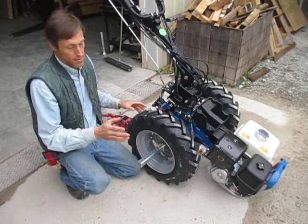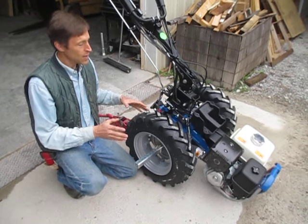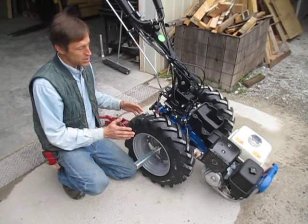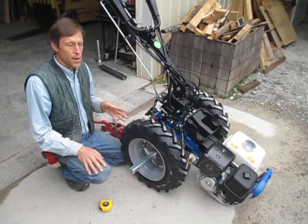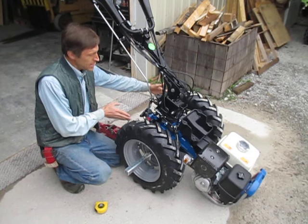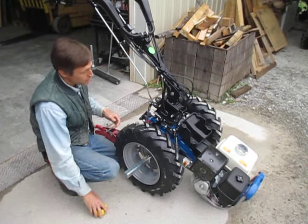Those being the ability to use the rotary plow when the wheels are slid into their minimum-width position. And to reiterate, as mentioned in earlier videos and on our website, for the rotary plow to function properly, you want something in the range of 16 to 18 inches between the two wheels — that is the free space between the two wheels.